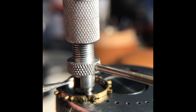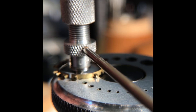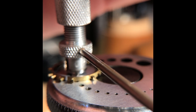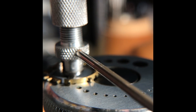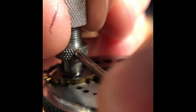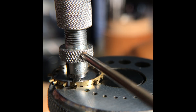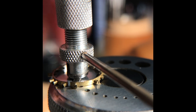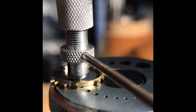I can look through this viewing window here to make sure that the tool lines up appropriately under the staff — and it is. One nice little tighten there. Your tool is preventing the flexing of the balance wheel arms. My magnet is in place below. A couple of taps, and the staff is out.